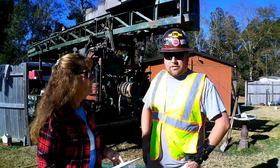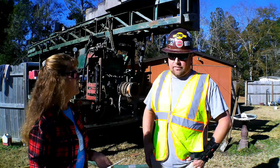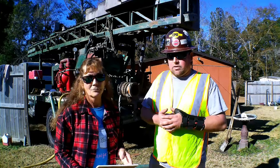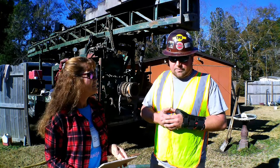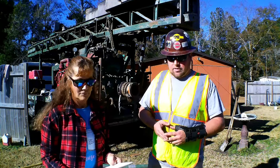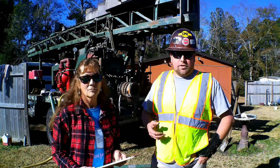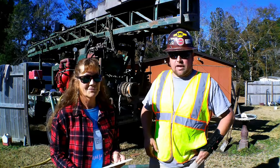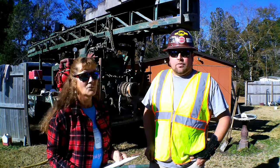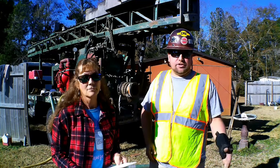So what's involved in setting up a well for the long term? Well, there are many different ways to drill and install a well. I work with homeowners all the time who have installed their own wells, or I've installed shallow wells by hand. A lot of people see things you can buy at Lowe's, well points that are driven, just galvanized screens driven into the ground 10 or 15 feet. Depending on your material and the water level, those can work, but normally will not work for high volume and usually will not last, not dependable for years and years down the road.